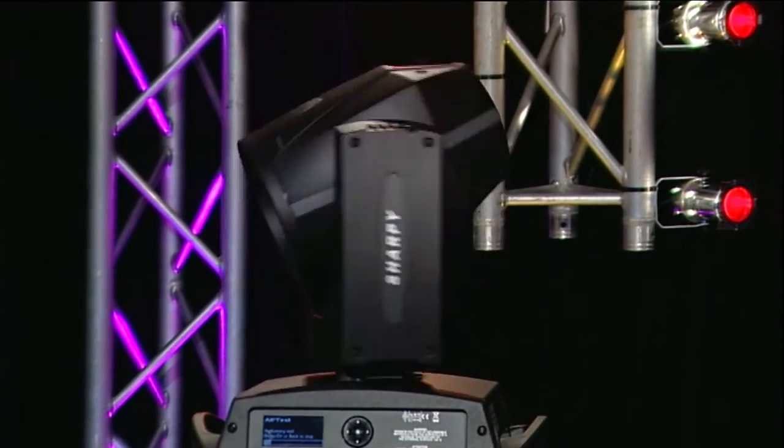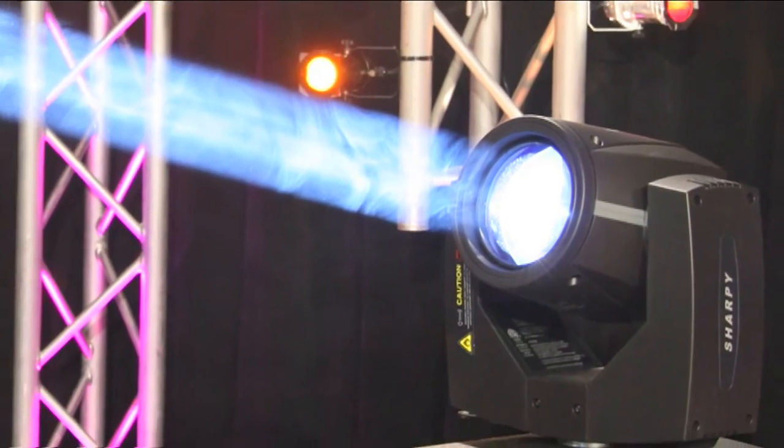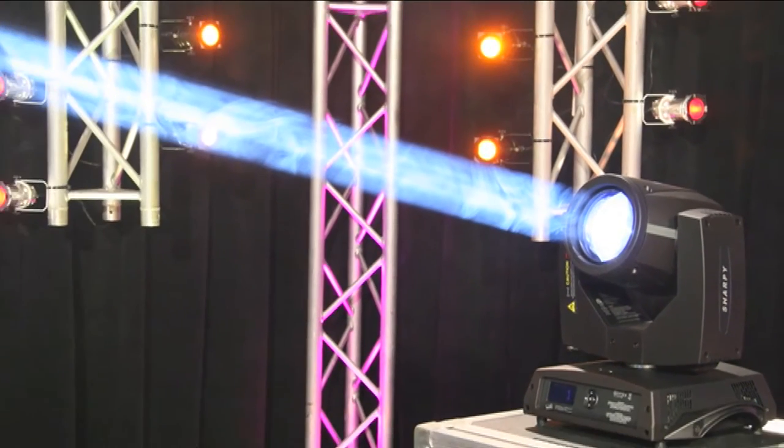This has been becoming a very popular little light even though there's not many of them around at the moment. I think it's basically going back to simplicity. It's a really good grunty beam light which is very fast. It's almost old school where we used to spend a lot of time working on beams, where everything these days has been gobos and colour changing and really big. It's small, it's really quick, and the beam that comes out of it kicks bottom, which is lovely. It's a 0 to 3.8 degree beam spread — that's nothing to a pin beam.